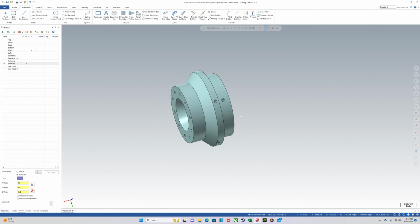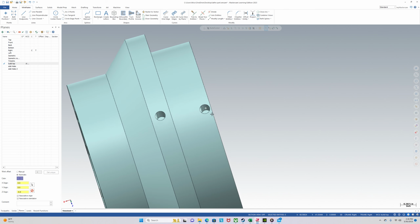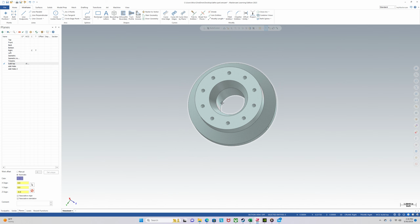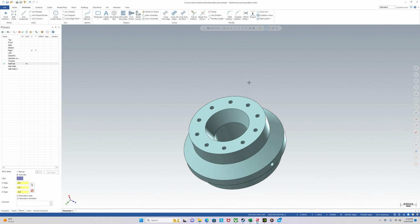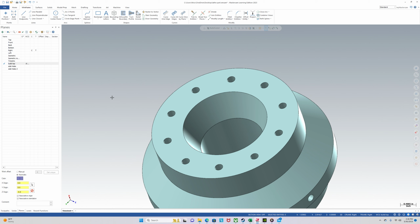So we basically want this thing to be away from the table, right? Away from the table being over here, so our tool can get to this hole and then to this hole right on the side. So we want to design a fixture that gets it up and away from the table and then goes through here and then has a threaded hole and has a cap. And the cap should match the angle right here, and then it'll hold it into place.